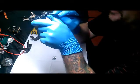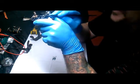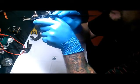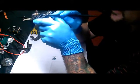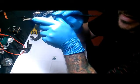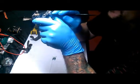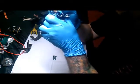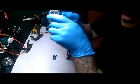Space between the rear armature bar and the rear spring seat is important too. The less space you have between these two, the more rigid a bounce you're gonna have, so the more rigid, the higher the spring tension. At any rate, spring tension is very important. The higher the number, the stiffer the spring.